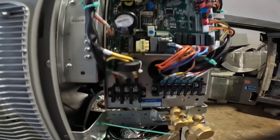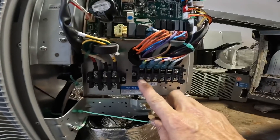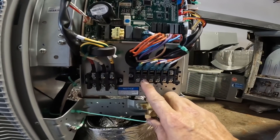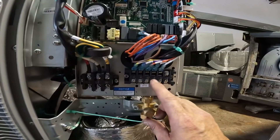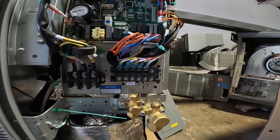I think this is what they're going to call their main board. My two line voltages, ground, and as you see here we have yellow, blue, W1, red, common, and green's not being used. Sometimes these will have a D on them.